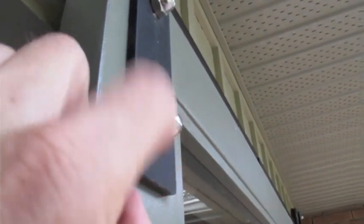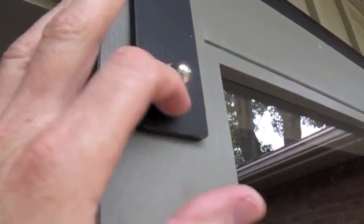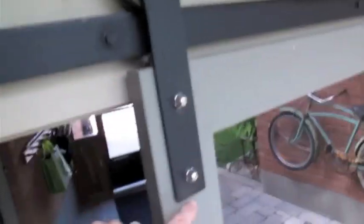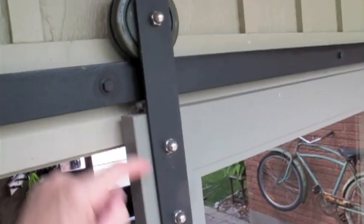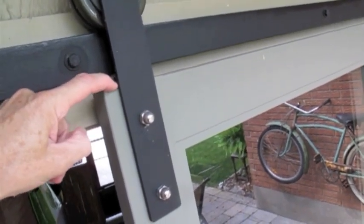These are specially acorn caps that I got at Home Depot — three-eighths inch. They may not be stainless, but they've been up for two winters now and haven't shown any rust, so I think they've got some stainless capabilities. The bolt that goes through the wheel is the same size — two inches, and it just comes straight through. These bracket pieces are 12 inches long, with five and a half inches from there to the top of the door, and the rest is down below.